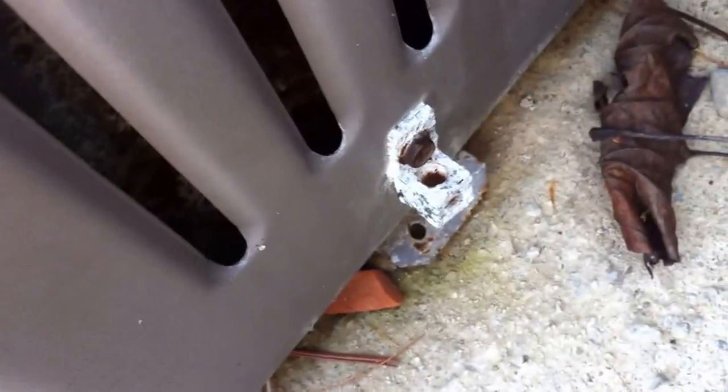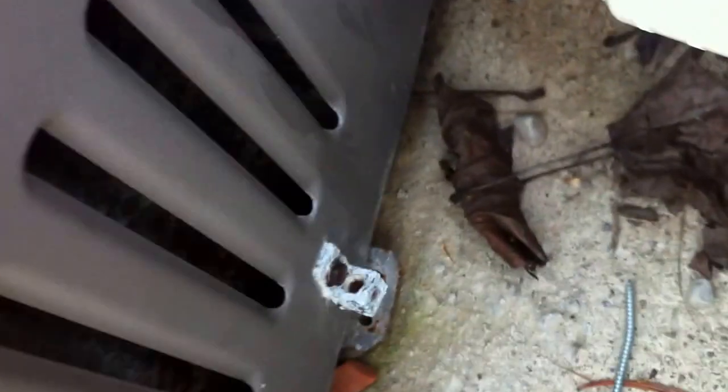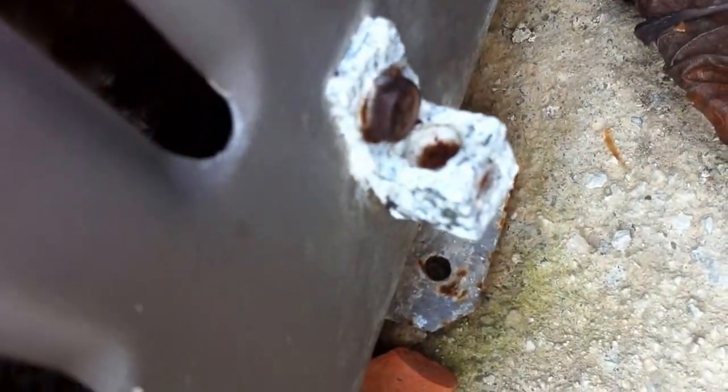The only real deficiency I see here is that this heater is not bonded. You can see just how much galvanic corrosion is on that copper bonding lug — not good. There's another one there, so both of those should be bonded.